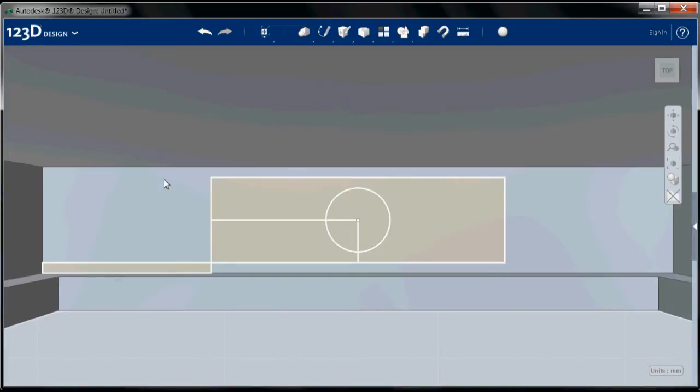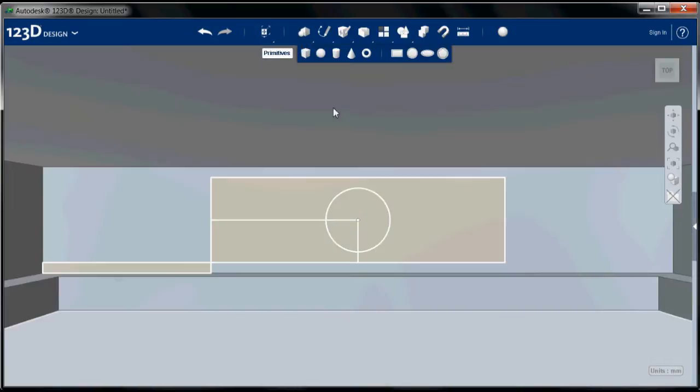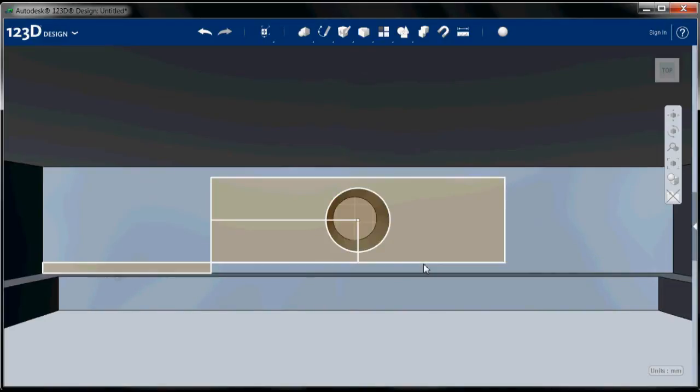Now I'm going to extrude this down into the solid. So I will choose the area I want to extrude down. I'm going to extrude the hole all the way through the part first. So I'm going to chain select with a control click and a control click both parts here. We could trim these out, but it's not really necessary. We can extrude the sum of these components. Construct menu. And we're going down, so I'm going to do like minus 40 because I know that will go all the way down through. There we go.